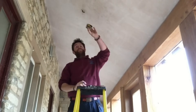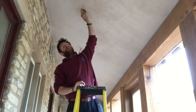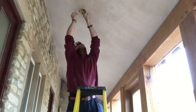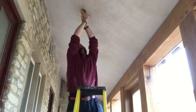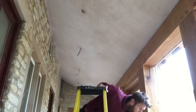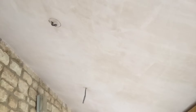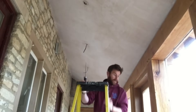I've pushed this cable back up into the roof as much as I can, and now I'm going to use the hole saw cutter as a template and place it exactly where I want this light to be. The datum line — this blue mark here — is up to the side of the hole saw. I'm just going to draw around it. As you can see there's now a mark on the ceiling, and now I'm going to use my pad saw to very carefully cut this out.